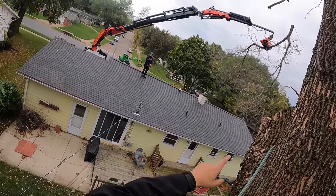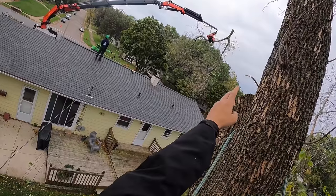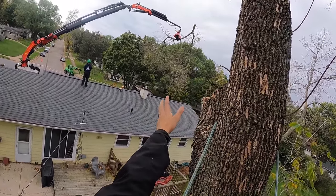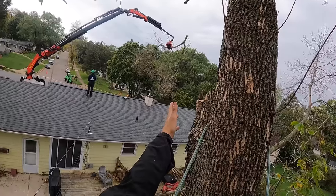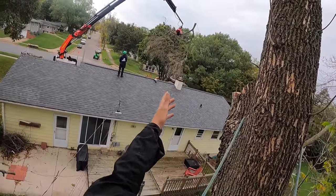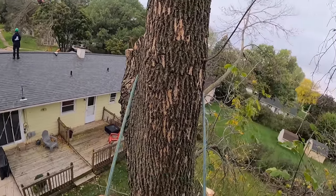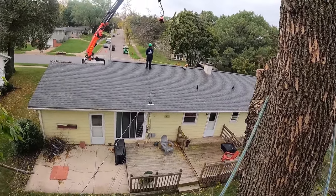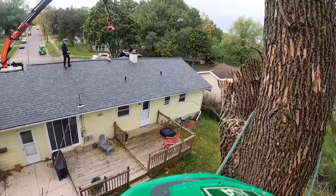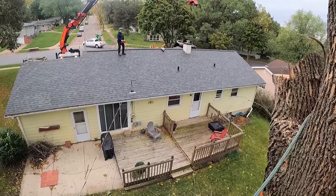Yeah, right. So Reon knew that was going to flip because of that lateral, because it's one point of attachment. So we just know that. I might have to duck a little bit and that's fine, as long as we're cognizant of that. So the picks move a little more, but you don't have to sling them up. So it's really pretty great. You also save a little time because people don't have to undo the rigging, even though your slings are really fast.